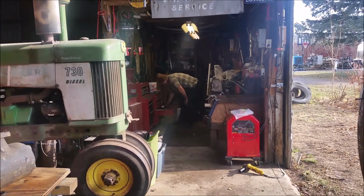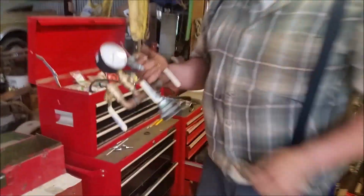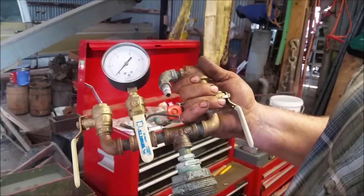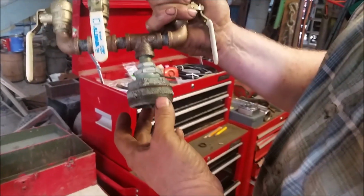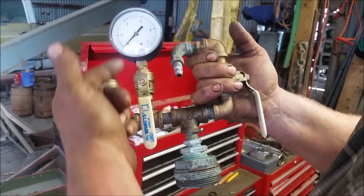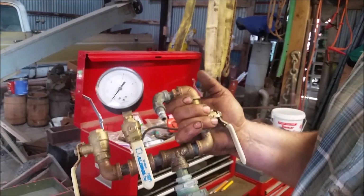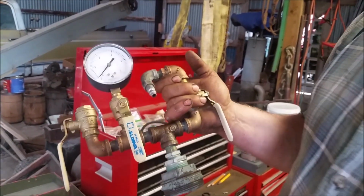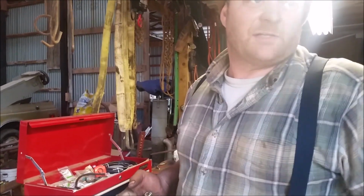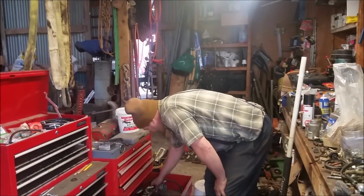And then once we get done repairing them, this is my tester. This is a manifold that he made for sticking on top of a low pressure gauge. Big tankers, a lot of them are 3 pounds. You can just get this plumbed into anything. On a big tanker, this would end up going into a cam lock. You give it supply here as you want. I've got it so you can watch the gauge and stop the flow. And this is my exhaust. If we were going to use the tank for fuel again, but this one's probably just going to be used for oil, so it's not that big of a deal. With everything I did here, this tank didn't actually leak at all. It just had some really iffy thin spots, so it's not worth anything. We're just going to use it for something like that. But that's how we test them when they're done.